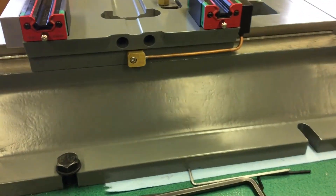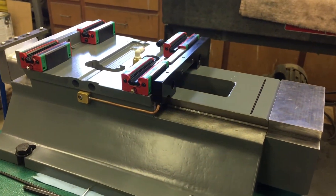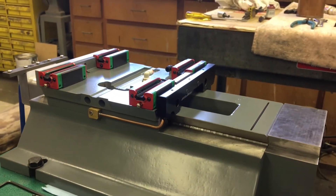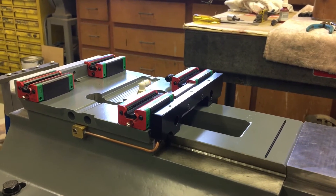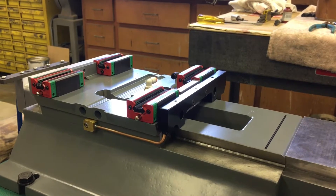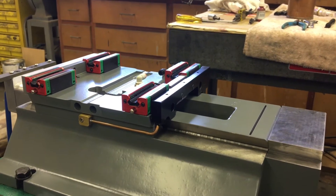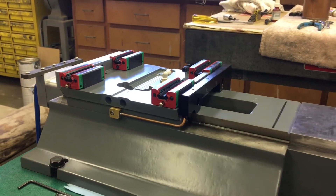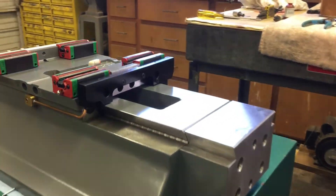The last thing I put on was the saddle, or the Y oil manifold, and that worked out pretty well. Earlier in the project, when there were still regular ways on the X axis, there was some concern about oil metering — or the lack of it. Funnily enough, in the end it sort of semi-rectified itself as we slowly but surely removed the dovetails. So now the one-shot oil pump is only feeding the Y axis. Should work — hopefully. If not, we'll figure it out. No biggie.